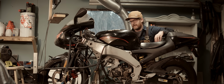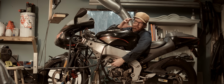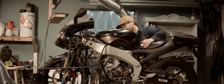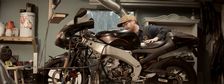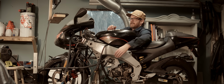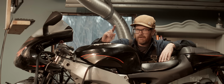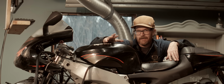Probably maybe that seal, because the bore was a little bit tight, maybe that was too squished and too tight on the axle. And maybe the same thing for the other seal, which is deleted now. And maybe something in the rotary valve was distorted in a way that made it rub, because now it's acting like it should. No heat developed, and the crank is no hotter than when I assembled the engine. Rest of the day off to do some stuff around the house, and then tomorrow morning.